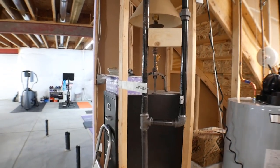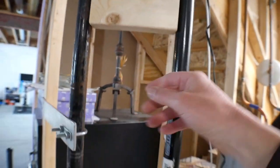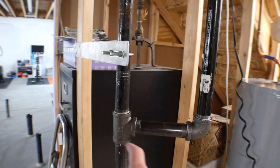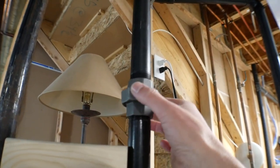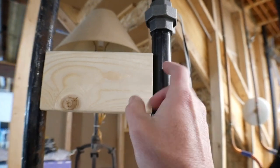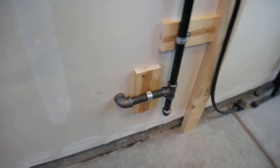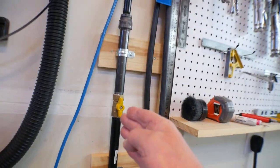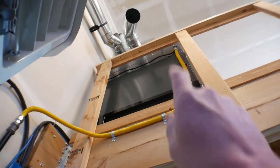It's always nice working on your own residential stuff because you'll never do as nice a job as when it's your own. Gas piping is not the most accurate stuff in the world, and by the time I had the T and all the fittings in, this piece was cocked in a bit. I put a spreader block in — had to move it out about 5/8 of an inch so it was straight — and I keep that board in there so there's no stress on the coupler. Then right here in the garage the line comes through the wall, I've got a drip leg, a gas valve, drops to half-inch, and a flex line that feeds into the furnace.